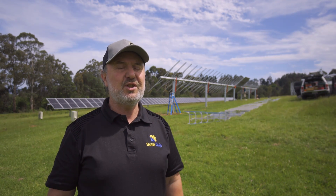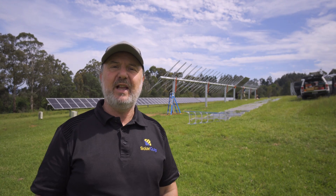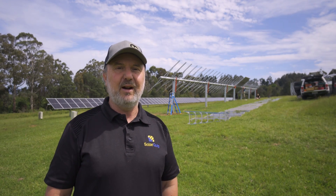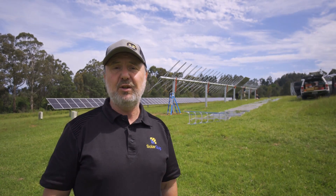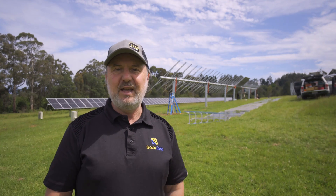It is quite a precision process. Fortunately today with the SkySmart 2 installation, we've got OTG. They're installing it with their precision equipment and their pile driver — they've brought all the toys with them. They've got their testing equipment to make sure the posts are firmly anchored to the ground as required. They can even pull them out again if they're not right, and they've got their rock drill if they strike rock a metre or two down.